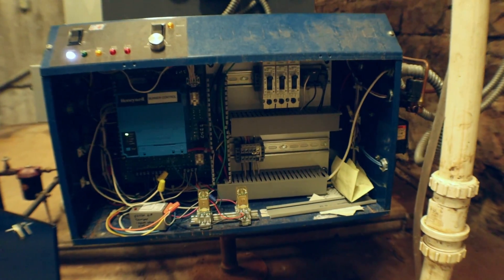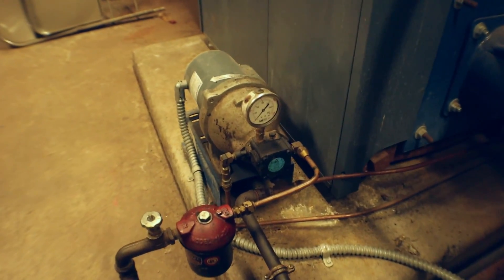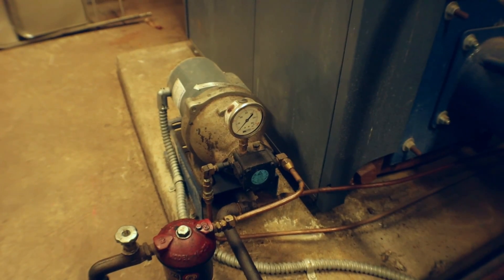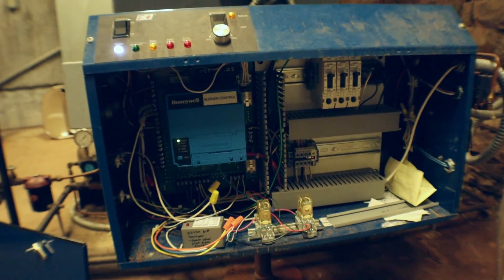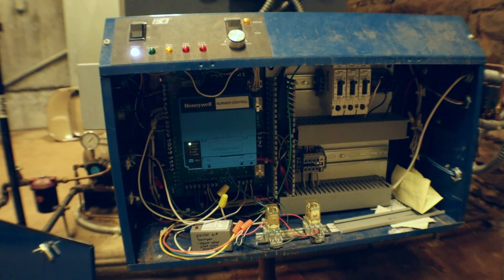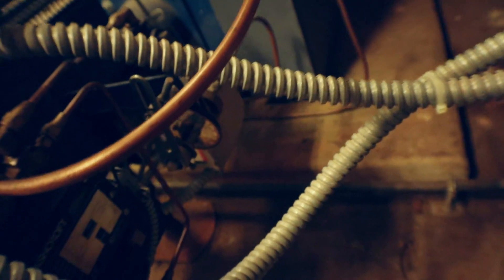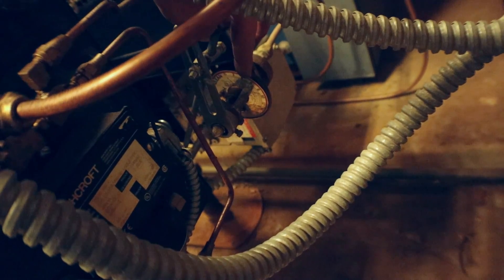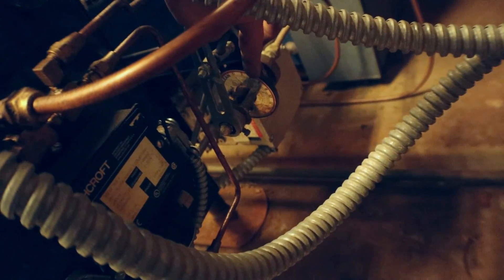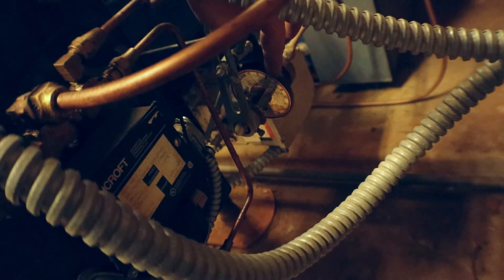Something a little different that you probably won't see on a residential burner — that is our oil pump right there. It's a higher volume oil pump on its own motor, designed to run at 300 psi in high fire. And how we control all of that — we have this handy little guy right here called a HALC valve. That actually works off the bypass of your two-pipe oil system. As you demand more fuel going to the nozzle, this bypass valve closes off and sends more fuel into the nozzle, and it opens up to send less fuel when you're looking for low fire.